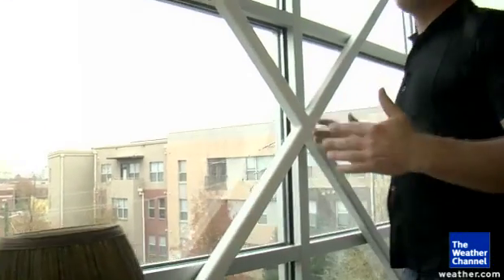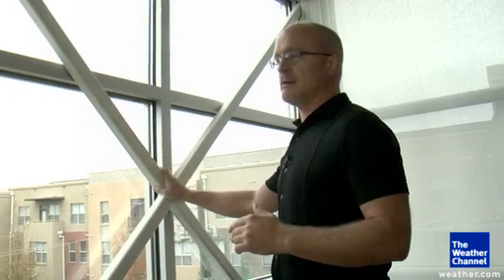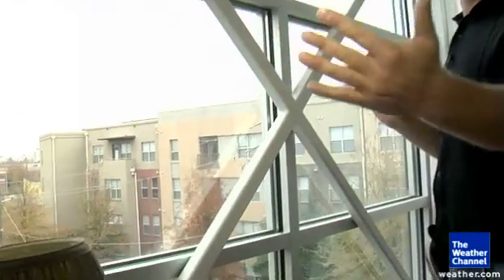This is the end where all the doors for the containers were, and it was very easy to take all the doors off and make this a whole glass wall. But because it's such a tall and narrow structure, what we had to do is put in this X bracing here to prevent the containers from racking back and forth. Once this X bracing was placed in on one side, it actually stabilized the other side because this other side was then welded to it.